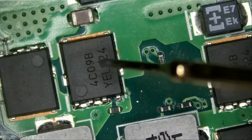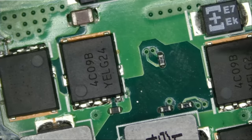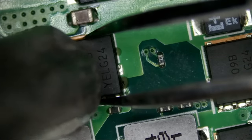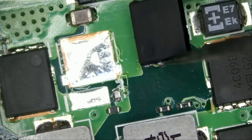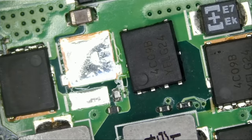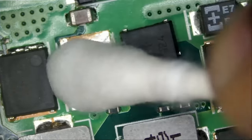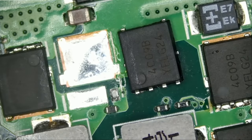I think we're going to assume the chip is okay for now and start with the MOSFET measuring the lower resistance. We always have to take an educated guess. Let's remove this MOSFET and see what happens. The MOSFET is out. Let's wait until the board cools down a bit because you may get the wrong measurement if the board is still burning hot. Maybe apply some alcohol.